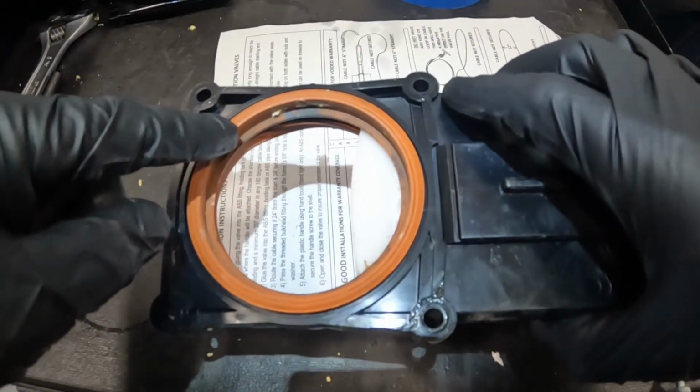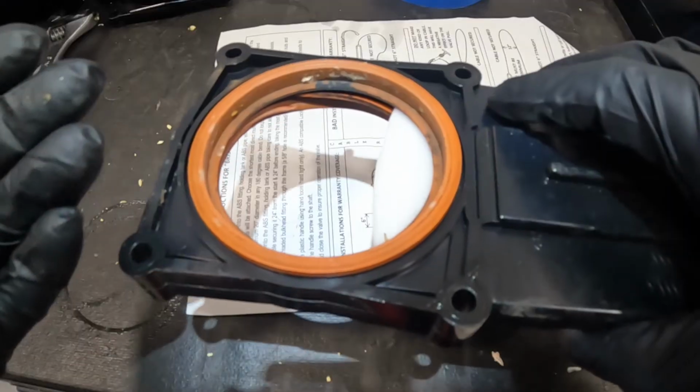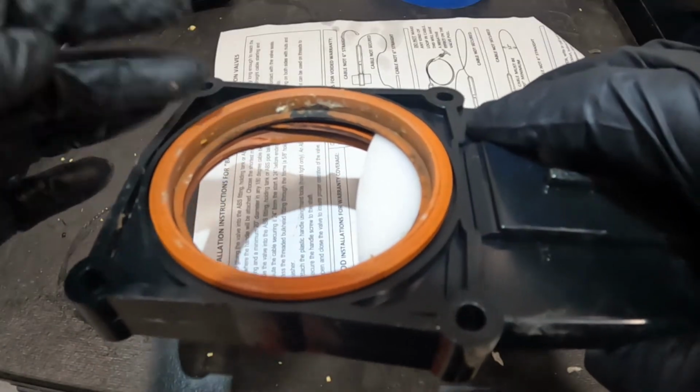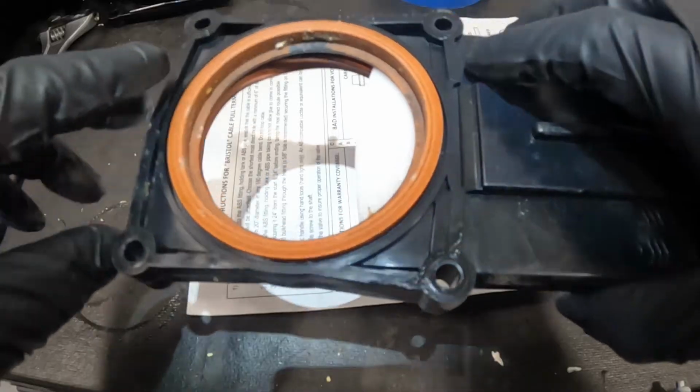So far we have no leaks, but let's take a look at the original valve and go over what my suspicion is on what happened. Now we have a little debris in the seal there, some dry toilet paper. That's expected. That probably wasn't causing any leak. So this side looks pretty good.